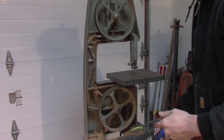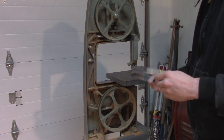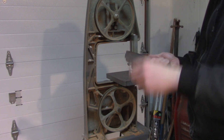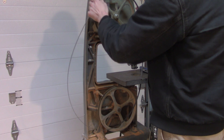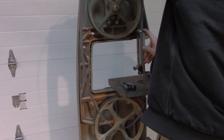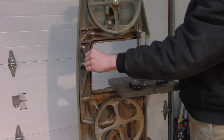This is sharp — it just got me a little bit on my hand. Let's open this up. This thing's going to fly open like a slinky. After making a few adjustments, I was able to get the blade to sit properly into place. Then once I got it in place, I tightened up the top nut, which pulled the top pulley up and tightened the blade to tension.